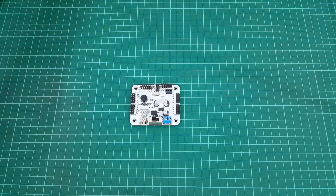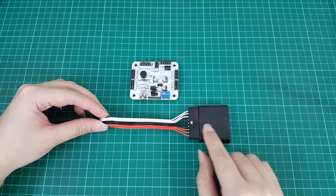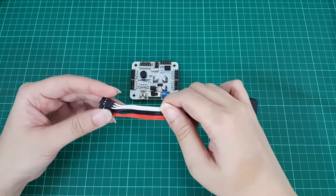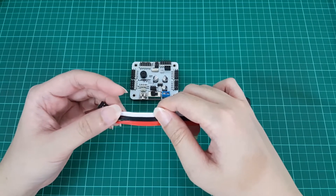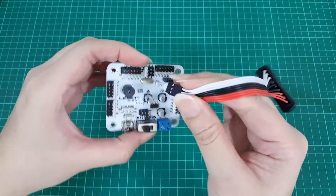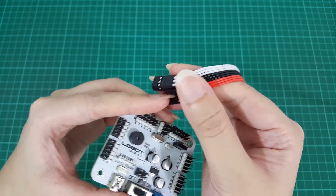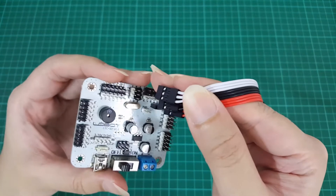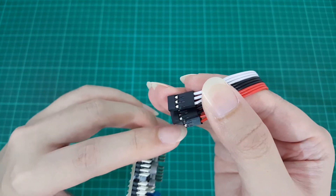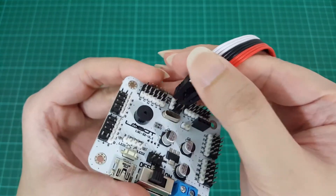Now let's look at connecting a PS2 receiver to the board. The PS2 receiver will have a white square on top, which indicates the top of the receiver. The cables — nine of them — are color coded into white, black, and red groups. You connect them by plugging the white section into the white part of the pins on the board, followed by the black and the red. The easiest way to confirm the correct direction is to check the openings on your jumper — make sure all the openings are facing the PS2 port before plugging them in.